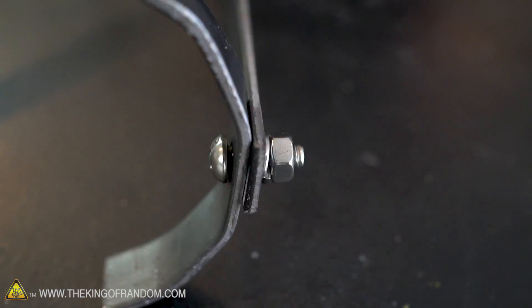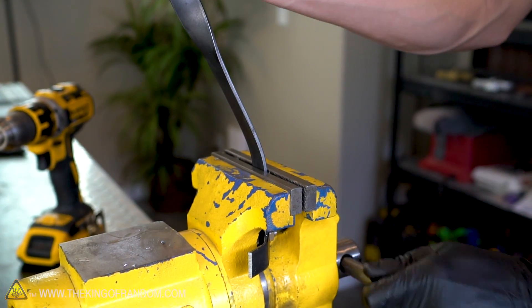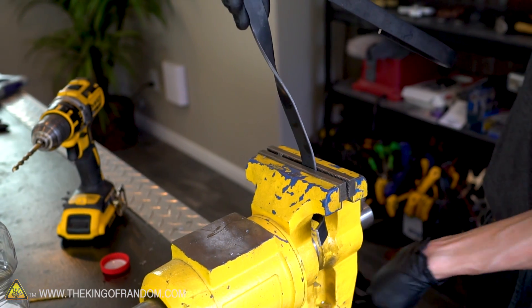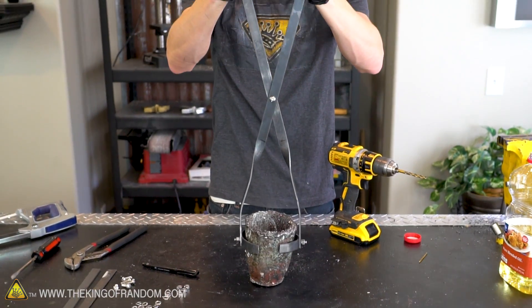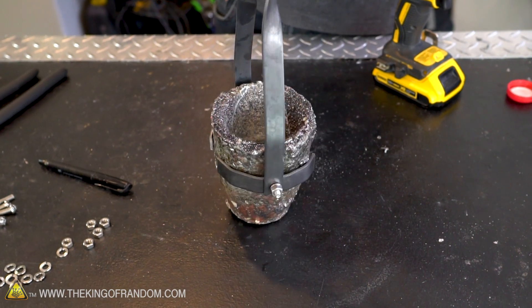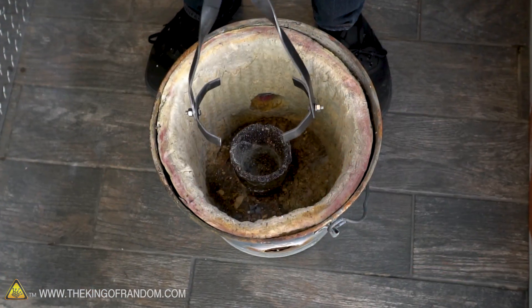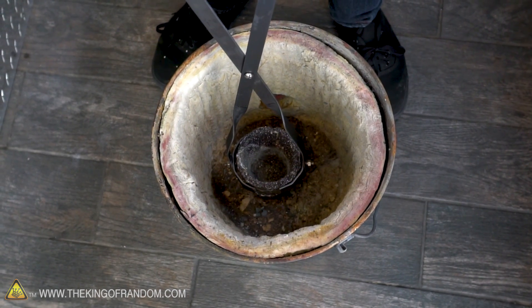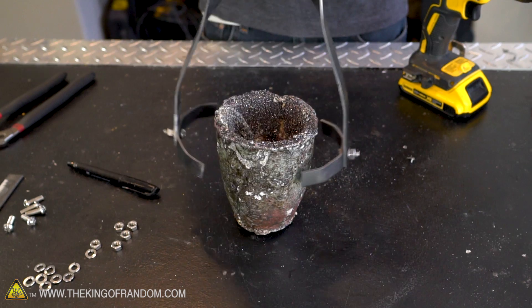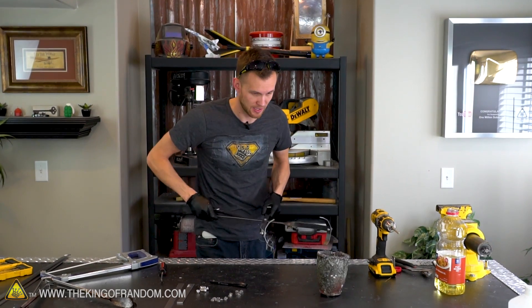It seems to be working, but I think we could make it a little bit easier to use if the claw pieces were a little more in line with the shape of the crucible — that actually means bending the bars a little bit more inward, so they're lined up with the direction the crucible sits. That is perfect — the claws are perpendicular to the walls of the crucible and easy to grab. These are working pretty well so far. Of course it'll be a longer-term test when we use them in the furnace — we'll see if the hardware holds up or if heating and cooling repeatedly weakens it. It's possible we'll have to come back and weld some pieces in place. We have tongs great for picking up the crucible from the top, but if we want to pour, we need a second set with the claws facing the other direction to come in from the side.